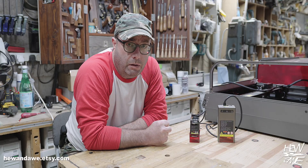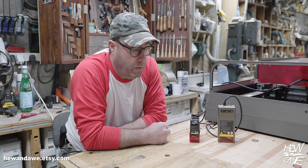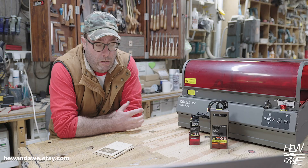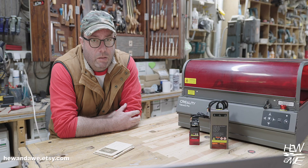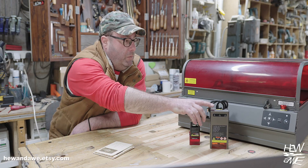So you've got a nice scale: at 40-watt full beam with slow speed you can cut decent thicknesses. That's really what makes this a good machine — comparing the three effective laser modules: the 40-watt, the 20-watt precise mode, and the 1.6-watt detail head.